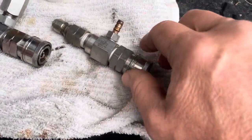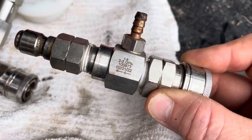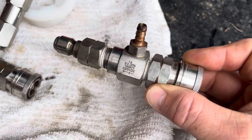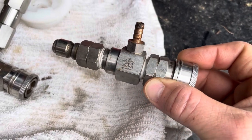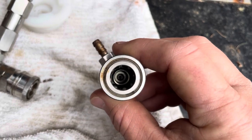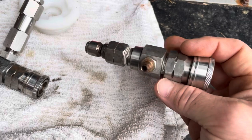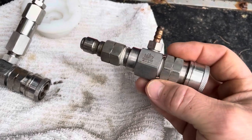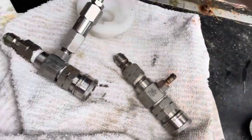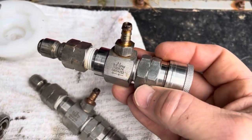What I've got here is two 1.8 injectors. These are the stainless steel GP Hydra injectors that I buy with the ceramic ball and spring. I buy them from Russ Johnson at Southside Equipment down in Kentucky. This is one I've been using a lot lately. I keep a 1.8 and a 2.1 on the truck and we swap out according to the jobs we're going to do.